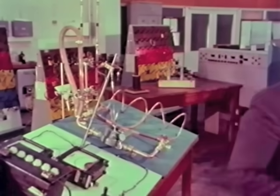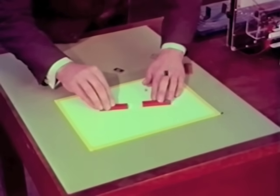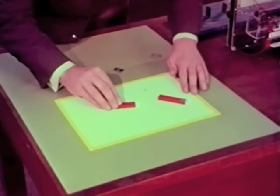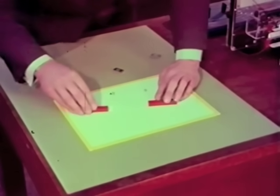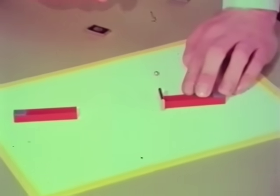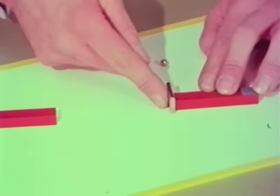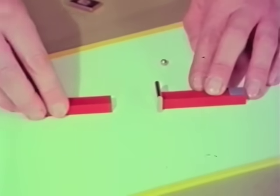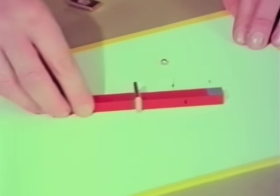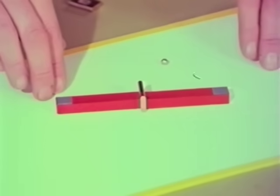Let me show you what I mean. I'm going to use two bar magnets and, first of all, I place them with like poles opposite — so of course, they repel each other. If I put a bit of steel now on the pole of that magnet, I don't change the polarity of it by just doing that. If that was a north pole before, then the outside of the steel will still be a north pole and so it should still repel the other magnet. Shouldn't it? Surprise! Now, in that condition, both magnets are pulling on the steel outwards — they're trying to split it in half.